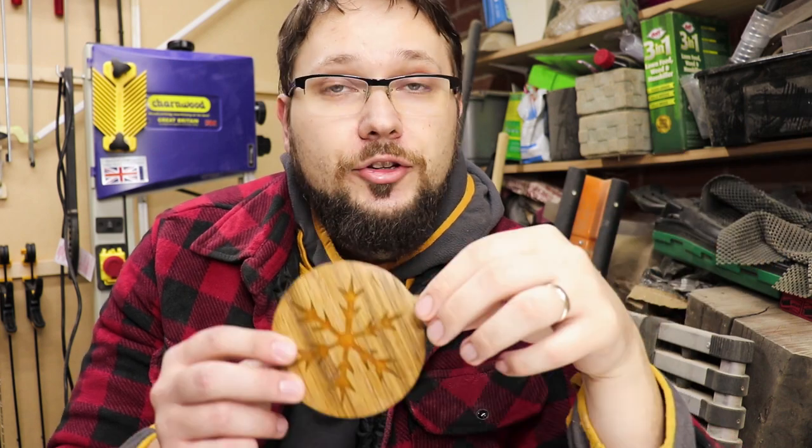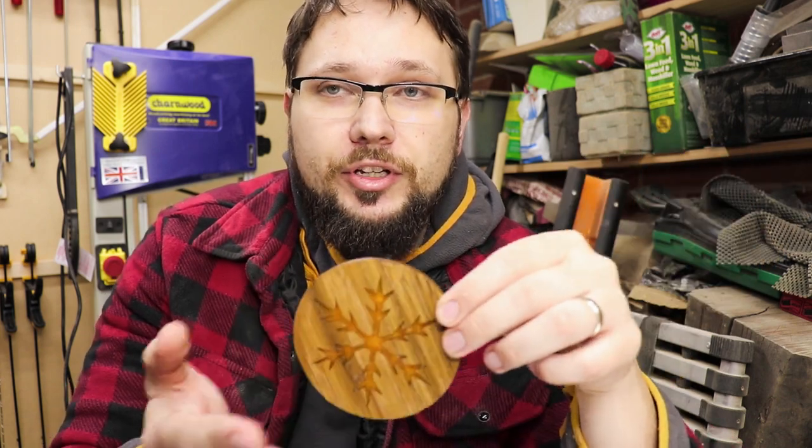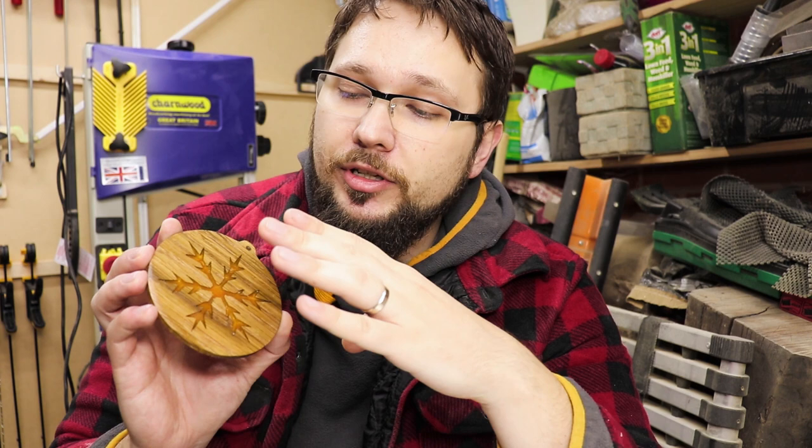The second thing I found, I used sellotape, as you've seen, on the back of these to make sure the epoxy will stay in place, and it did, and the tape came out really nicely and there weren't major issues apart from one thing. The sellotape in some places got rippled a little bit, and that meant on the back of it the epoxy wasn't level with the design, so additional hours on the sanding machine. I'm not really sure what to recommend, just be very careful, because some of them came out fine and some of them obviously had this issue, so that's me not being careful enough with the sellotape.